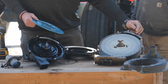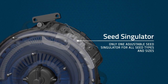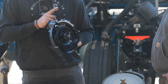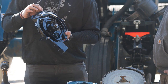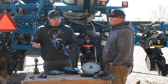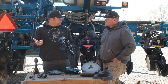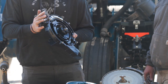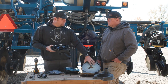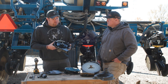The singulator on the edge vac is an adjustable brush style, while on the true rate meter it's a plastic bladed style with numbers on top. For corn, setting number two is for corn, with three micro adjustments in the middle. The thicker bar is more aggressive, the thinner bar is less aggressive. For a real small seed like a 35-pound round you'd move to the thicker bar; for a large 56 to 60-pound round you'd use the smaller bar. Everything for corn is done inside setting two, and you can run much lower vacuum — around 16 to 18 — and perform great on most seed sizes up to eight miles an hour.